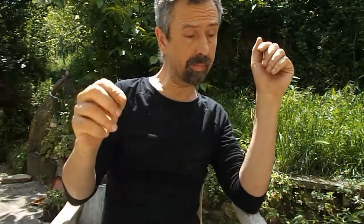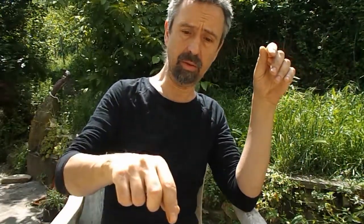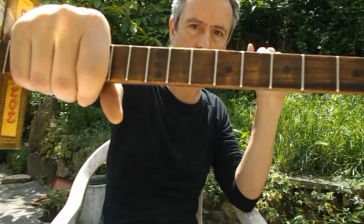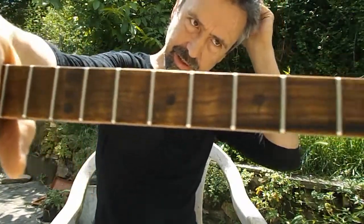And because I know the chestnut's high in tannin, the dowel I was using, I think, was something like birch, which I thought would be low in tannin, hence no problem. They'd show up light, whereas the chestnut would go dark. Unfortunately, it didn't come out quite like that, so they're virtually invisible.